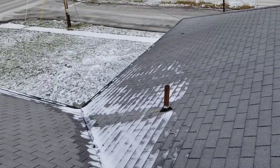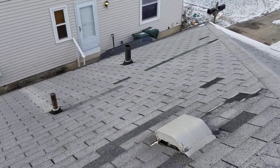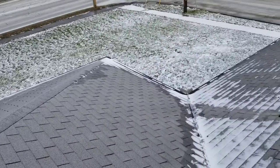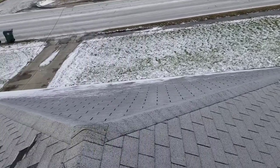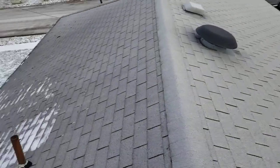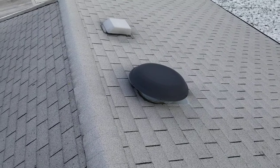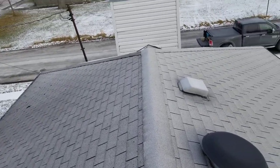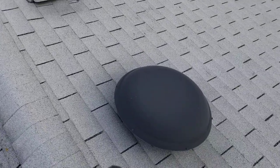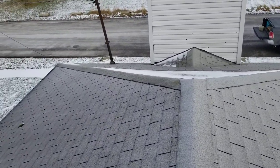We've got a pipe boot here, and all sorts of shingle damage on this side. Pipe boot, pipe boot. There is not enough ventilation in this roof. There's a power vent, and if we can get natural airflow, we recommend omitting the power vent completely — it's fruitless. When it comes on, air goes by path of least resistance and just pulls air from the other roof vents, sometimes causing leaks.